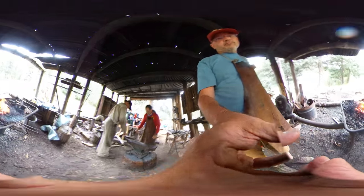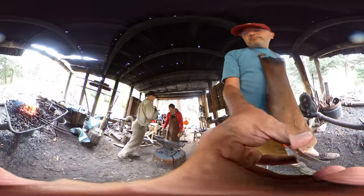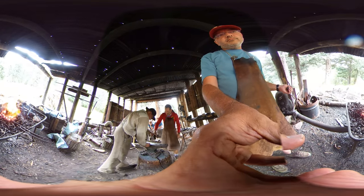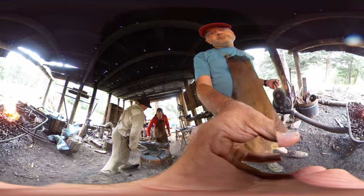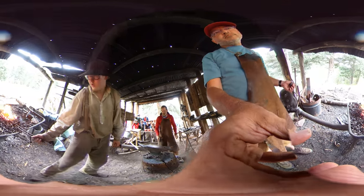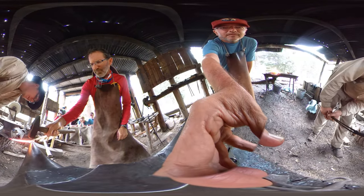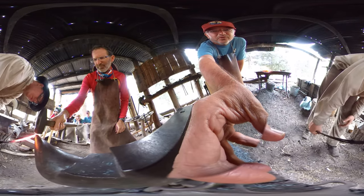So remember what I said — over here I'm straight up and down, right here, straight up and down. You will not be moving it from there because I'll be moving the metal for you. I'll then bring it over onto the face of the anvil. You will hammer straight at me. Then I will tell you to hammer straight up and down right on top of that. You don't have to hit very hard. A little bit harder — good job, Mr. Eunice. Hold.